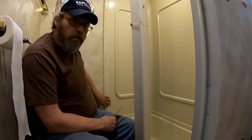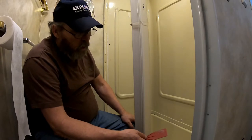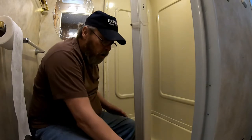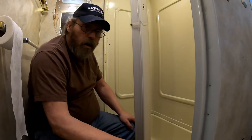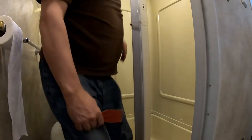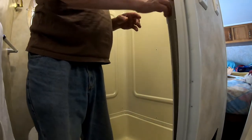You're going to have to pull all those little pins in there. You can take a putty knife or a box cutter blade and go around the bottom of the tub and cut that caulk so it will just pull loose. Let me show you how easy it is to take this thing out — camera angles are going to be kind of weird because this is a very small bathroom. Once you get all that free, it just pulls right out.